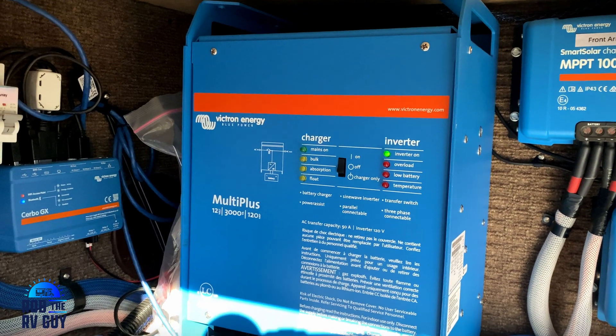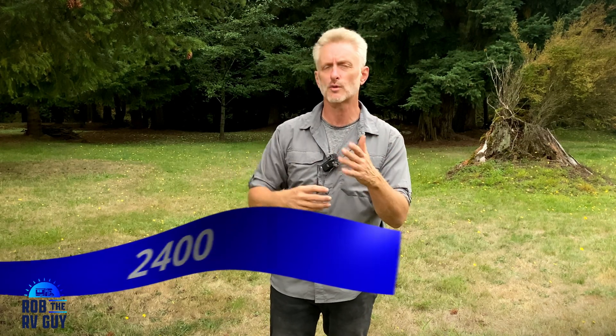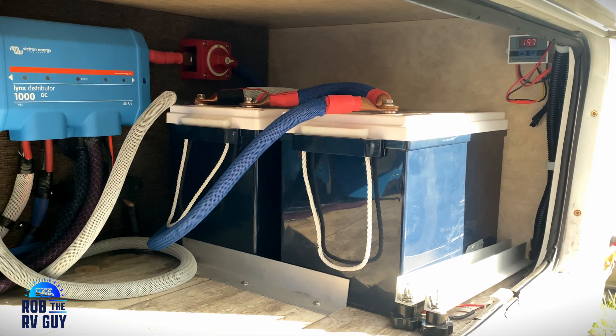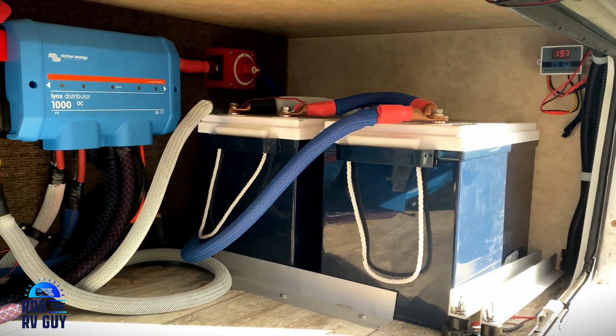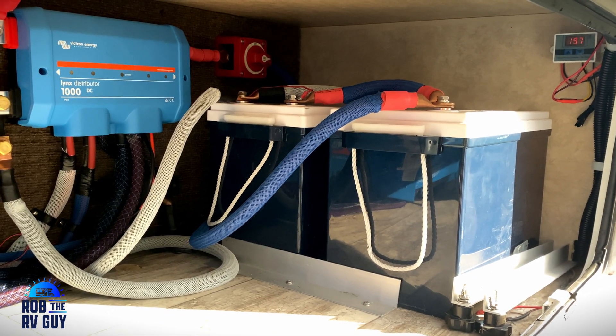When install day came, we started putting in the equipment. I have the Victron MultiPlus 3000 — this is the 12-volt version, though it's available in 24 and 48-volt versions as well. It's a 3000 VA unit that produces about 2400–2500 watts steadily and peaks at 5000 watts — more than enough for our 30-amp rig. The heart of the system are the batteries: I have two Epoch 300 amp-hour lithium batteries, giving me a total of 600 amp-hours, or roughly 7200 watt-hours of storage. They're heated, have their own Bluetooth BMS, and they function very well with the Victron system.